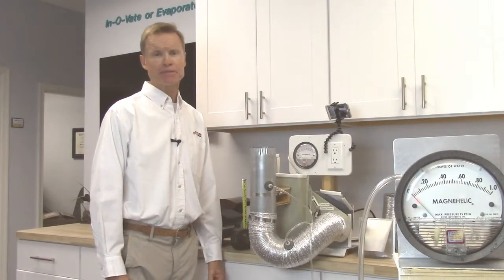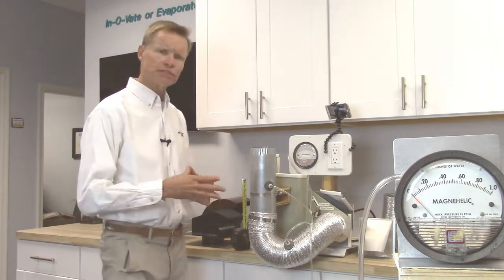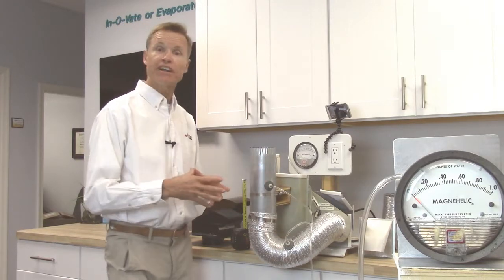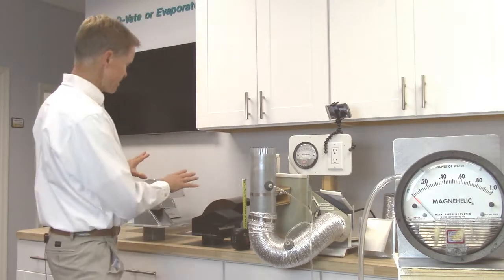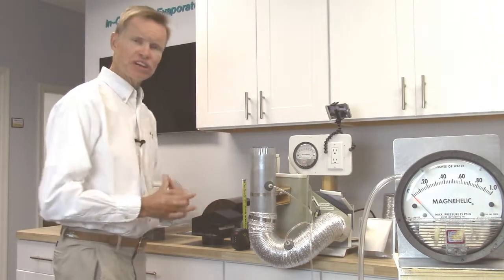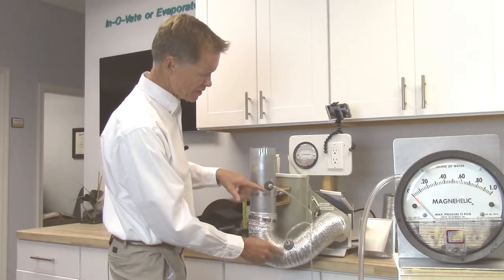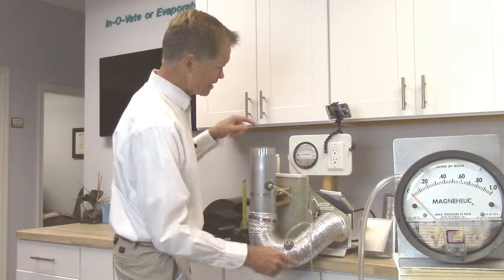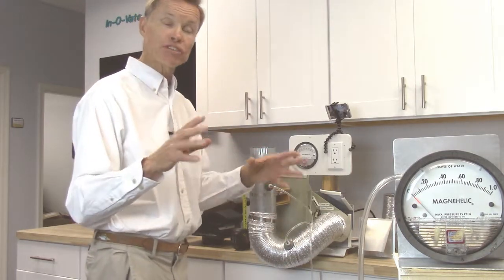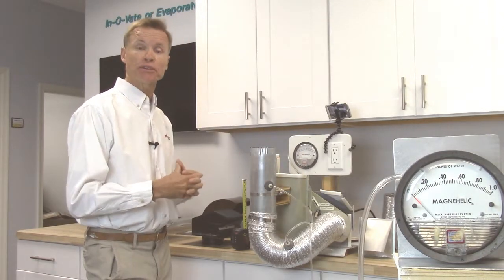You're just in time for a pretty impressive demonstration. This is the blower unit and rear end of a Sears Kenmore dryer. I'm using a ton to create a real-life environment as we test the pressures that these four different vents create when added to this exhaust system. I'm doing that by tapping into the exhaust system in two spots, running the tubing to T's and off to two magnehelic gauges that the industry uses to display the very minuscule pressures involved in dryer venting.